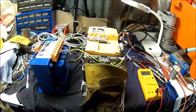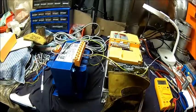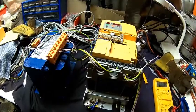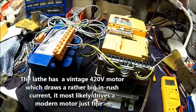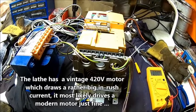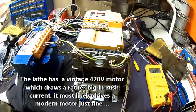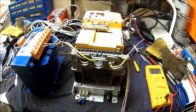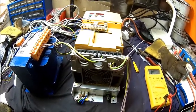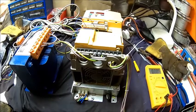I just need to pull the cable — it won't start the lathe because the lathe motor is 2.2 kilowatts and that drive cannot handle the inrush current; it's just too small. It's cold as well, so it's not going to work. We need a bigger inverter — it trips straight away, too much current.